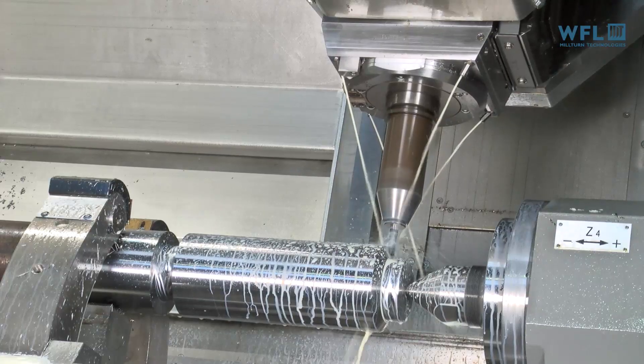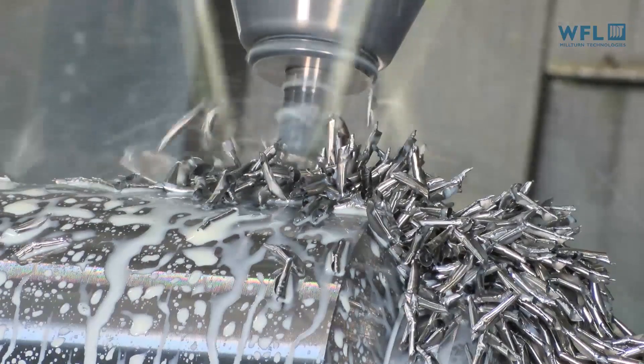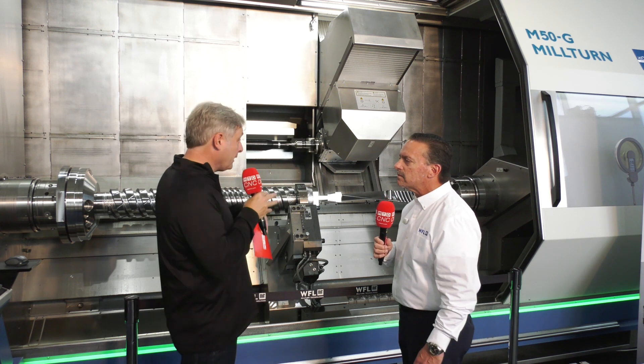It can accommodate up to 200 tools, and there's also a robot tracker that keeps the next tool close to the spindle, minimizing tool change times and keeping that spindle turning. There's a big B axis here as well — up to 45 kilowatts, with this particular machine running a 27 kilowatt version for what it's doing. Super powerful, tying in with those complex materials.